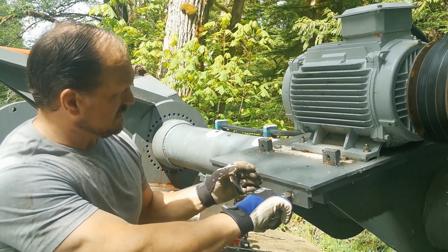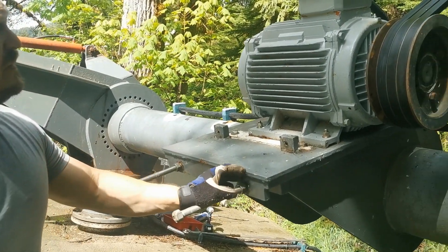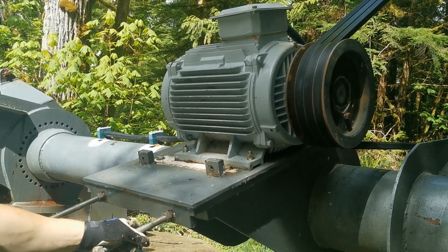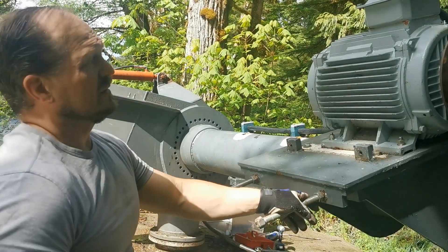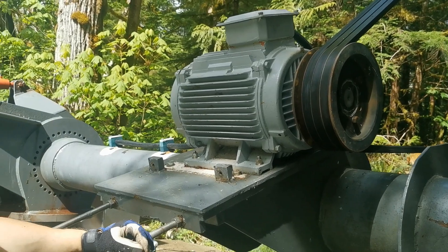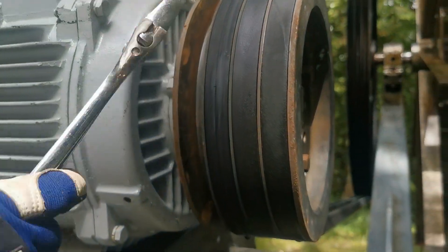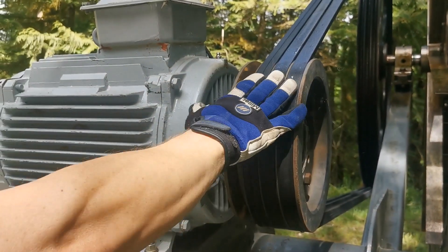So this is how I tighten the V-belts — I tighten these jacking screws and pull the motor back. It's actually quite amazing how much torque this water wheel puts out. It actually causes these three large V-belts to slip, probably because of the low RPM. These belts are sized for 100 horsepower or more, yet this makes nowhere near that, but it just makes so much torque it can cause them to slip. There's also the issue of belt contact — it would probably be better if I had an idler to give a little more wrap around the smaller pulley.